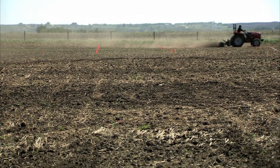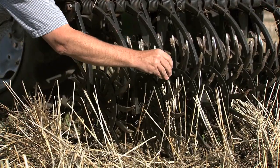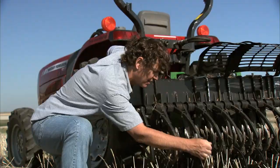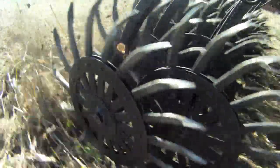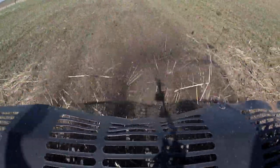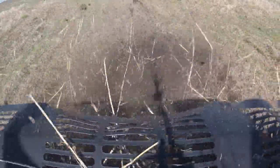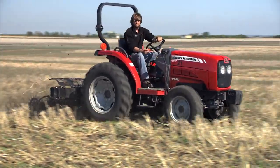I know what you're thinking: you're thinking you're a no-till farmer with lots of stubble on your fields, and this machine is just going to plug solid with all the crop residue. This here is a min-till rotary hoe, and the difference is that these have two separate tines so that they don't plug up with crop residue. They can go through a no-till field and flip right through the crop residue without plugging at all, doing a great job killing weeds even under no-till conditions. Eric has also found that even with multiple passes, the residue still remains on the soil surface, protecting it from erosion.